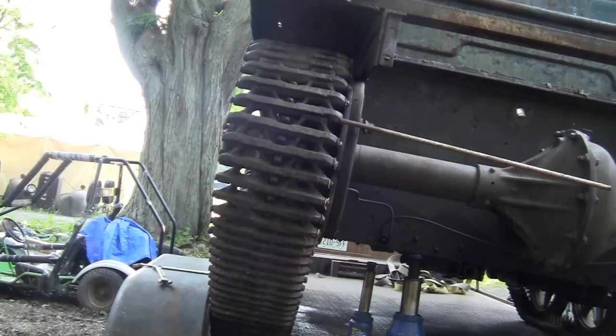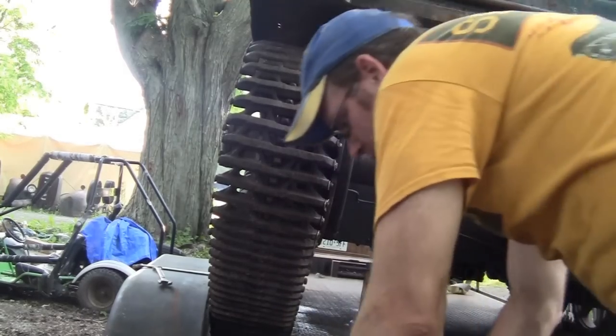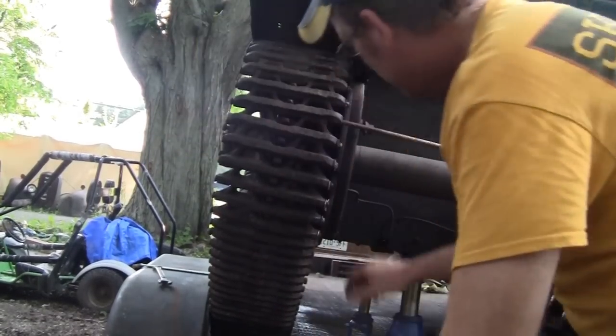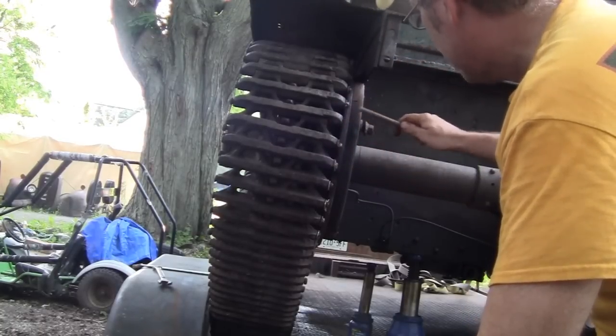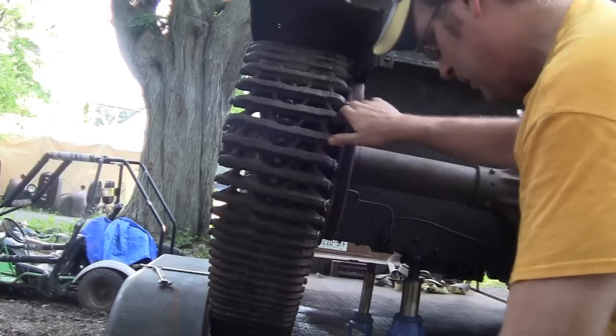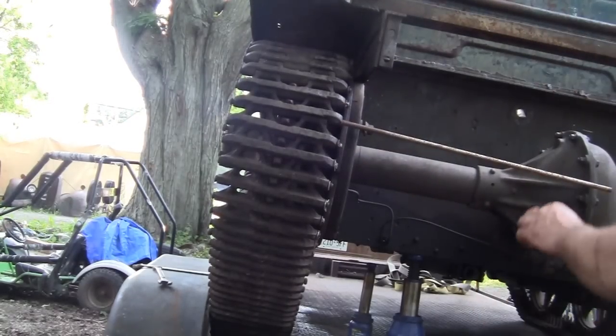While I was reinstalling the track, I found a broken track pin, so we're going to reinstall it. I may have to put the ratchet strap back on to pull this straight — it's now at a kilter, I can see it. That's probably why my track flew off.